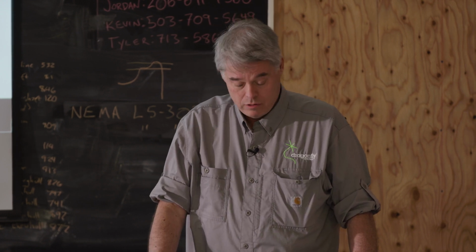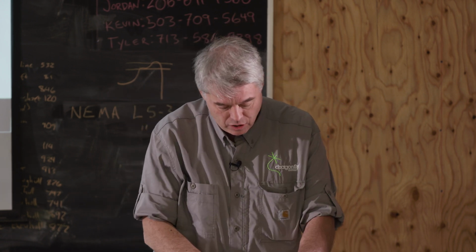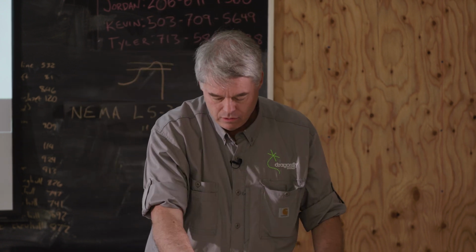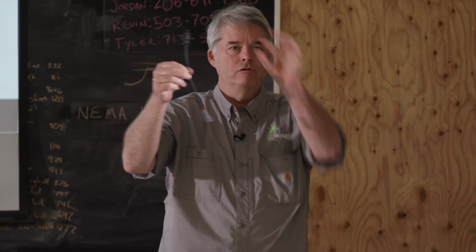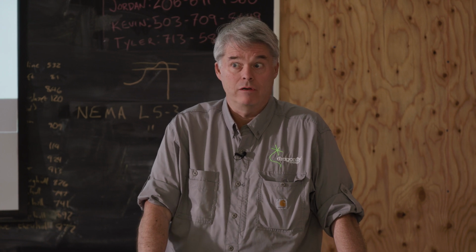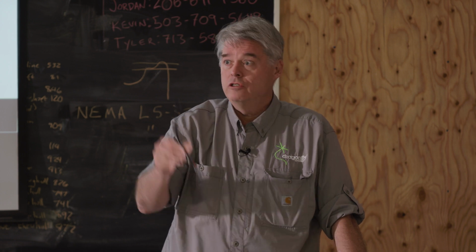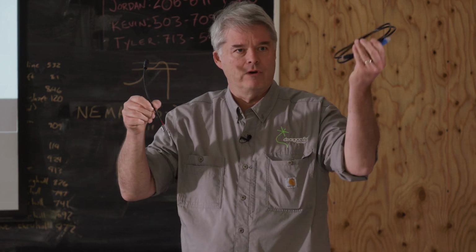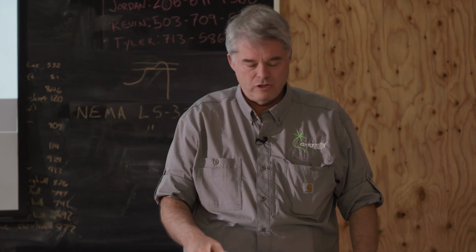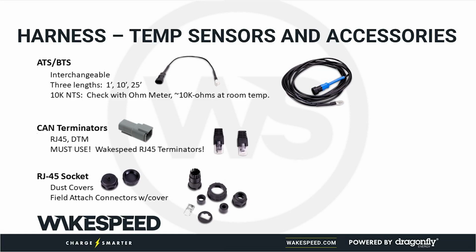For the marine world, I would say, if you're going to do installs, you're either going to do a Victron-centric one with this, or use the NMEA 2000 adapter and use an NMEA 2000 backbone. Okay? And that's going to be driven primarily by whether your customer wants to see Wakespeed information on their NMEA 2000 display. If they do, just go this way. Forget the RJ45 with Victron. Get the Victron NMEA 2000 adapter cable and just use this. It's a nice, really clean install. All right. What do we got next?